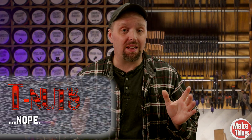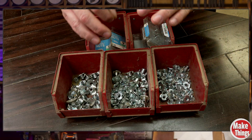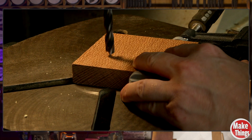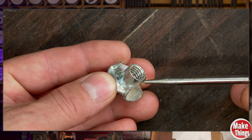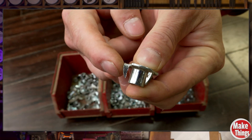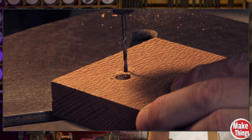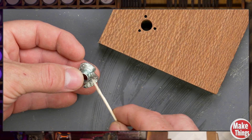But I'm not going back to T-nuts, and here's why. I've stocked so many T-nuts in the past because I use them so often for making knobs. To make a knob with these, you need to drill a hole for the barrel — you can't hammer them straight in. There's a bend risk with the tines. So you slide it into a hole, give it a few taps, then drill out the marks the tines left.